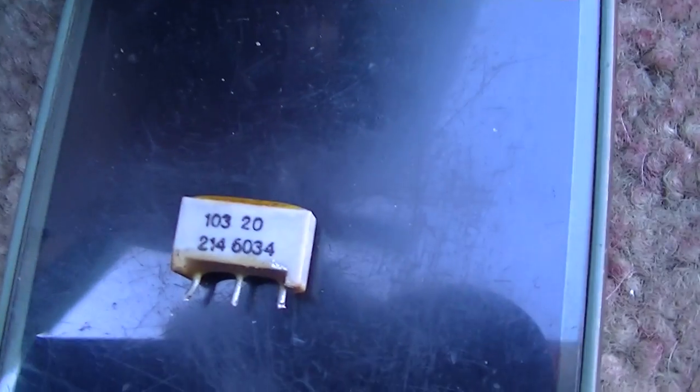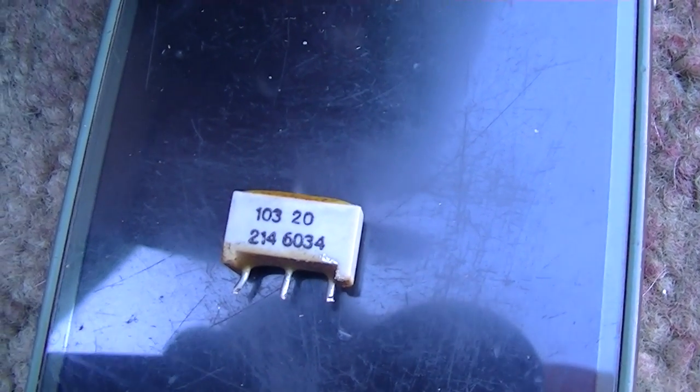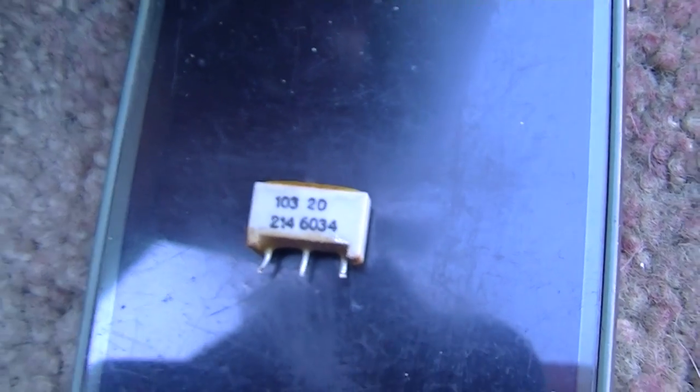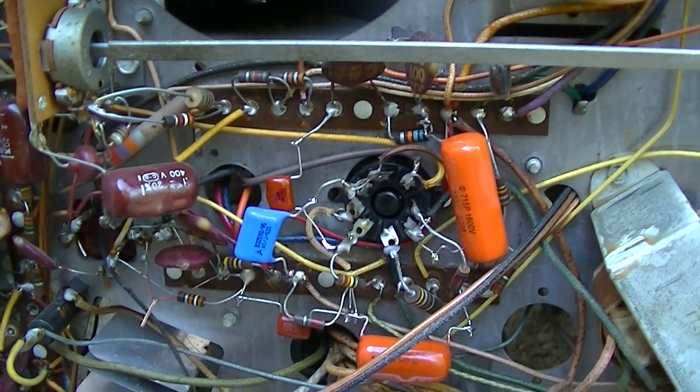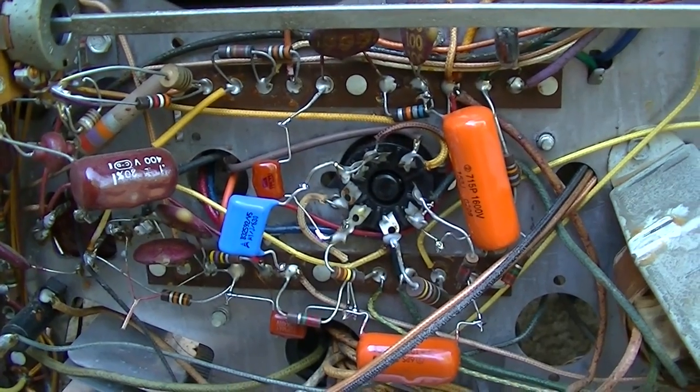These things should almost just be a maintenance item like recapping. I think you should just, if you have this old selenium phase detector, just change it in your TV. One thing I'm seeing here is there's this vibration. I don't know if the camera's showing that. But it's like the whole thing is vibrating vertically real fast. And I wonder if that's from a bad integrator. I just ohmed out those two integrators and they seem to be okay. They're not open or super high resistance.